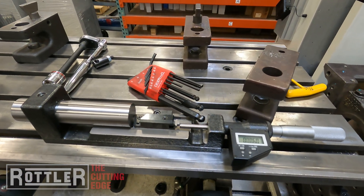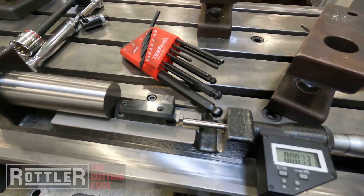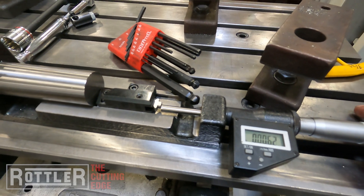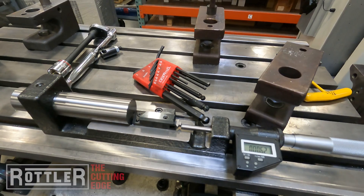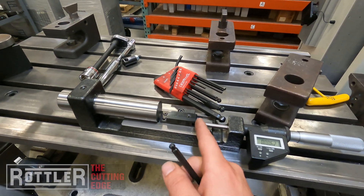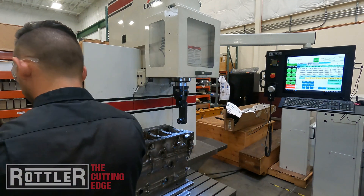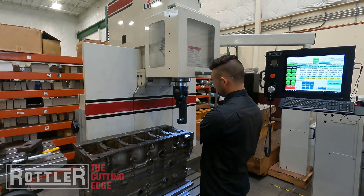For today and for this demo purpose we're just showing the operation and we're going to take a little bit more out of this. I've got it set to 6 thou out. With these I always like to double-check, so I'll spin away and come back and touch to make sure I'm repeating. It's even a good idea to sometimes take this out, place it back in, and just make sure — because you can have some variance in here. Sometimes you've got a little dirt in there or the spring moves on you.